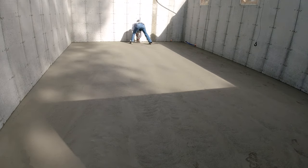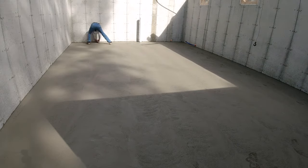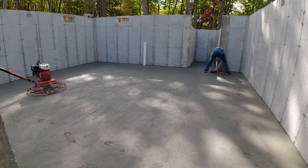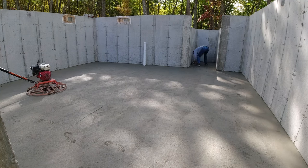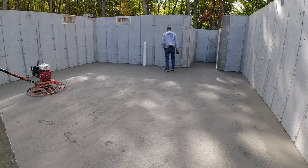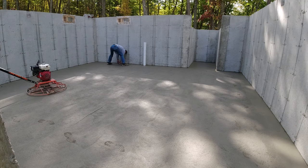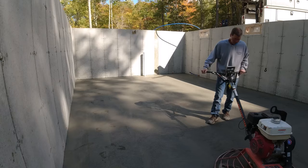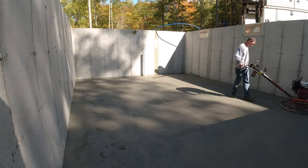If those edges aren't good, anybody who knows anything about concrete floors is going to look at them and know you're not a true concrete finisher. We spend a lot of time on the edges. This is actually the second time I've gone around — first with my mag float to get them flat and filled in nice, then with a 14-by-4 steel hand trowel every hit, wiping out that bulkhead area by hand since it'll never see any sun.